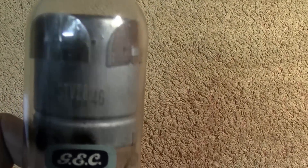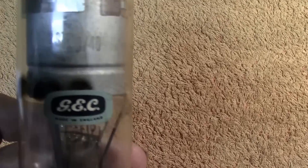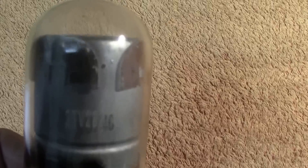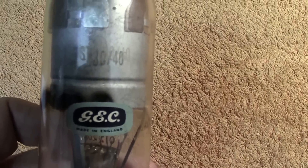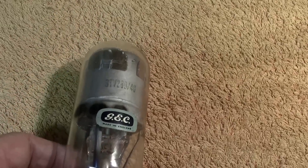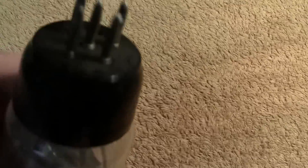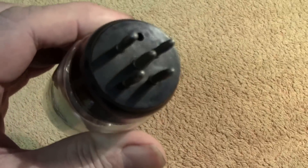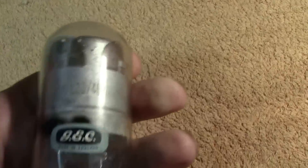I have mentioned that the neon lamp can be used to stabilize a voltage. This is done by the actual striking voltage between the two electrodes reaching a particular striking voltage, and that is what it will keep the voltage at — it will stabilize it at that voltage.